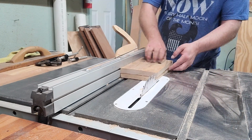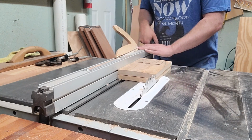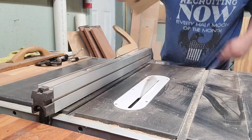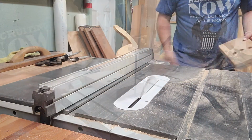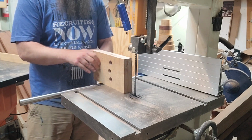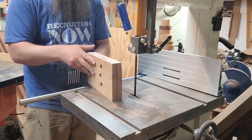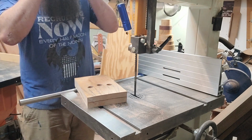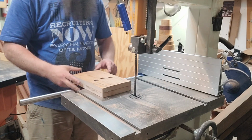I'm going to give these a quick trim up to make them flush on the sides so that I'm a little bit closer to having the exact same pieces of wood. And now I'm actually going to mark the end of the fingers with the bandsaw so that when I peel these things apart, I know where they are on both boards and I can do my resawing, cutting the curves into them and still have the spots marked after I lose my pencil lines. And I'm going to leave the outside ones for last so that I have a nice surface to be running them this way.